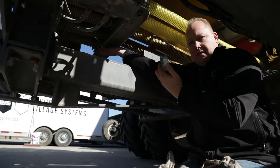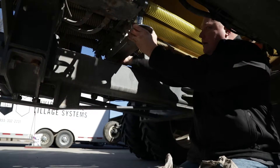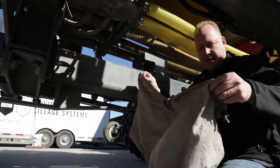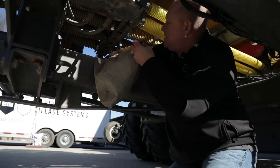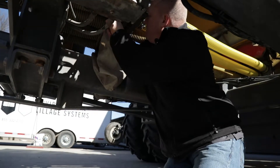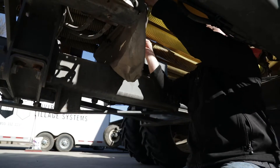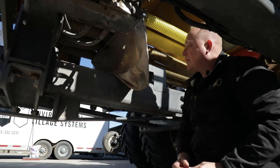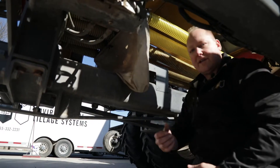The first thing we'll do is remove these d-nuts from the meter body bottom collector insert. This comes out and we will simply take our meter calibration bag. I generally like to have the drawstring towards me as we have to reach across. Just slide it over the end and pull it tight. That'll hold tight while we catch our fertilizer — typically anywhere from 15 to 25 pounds.